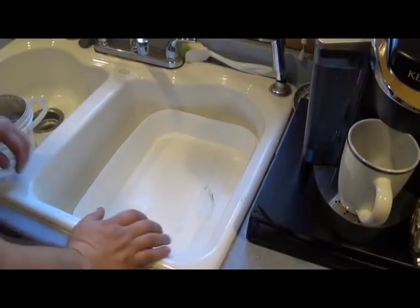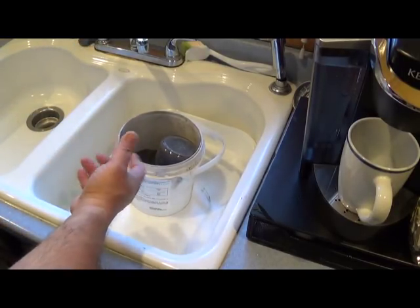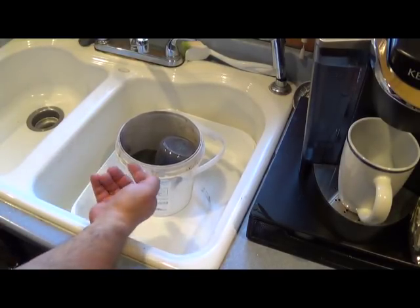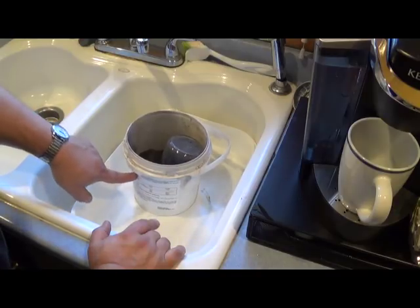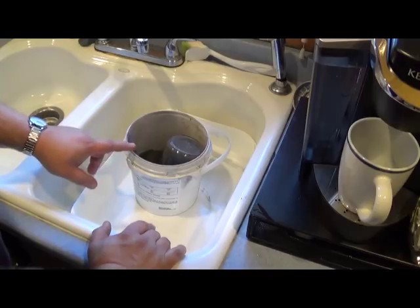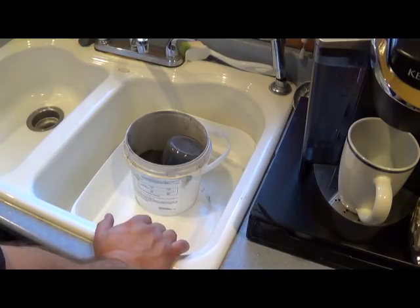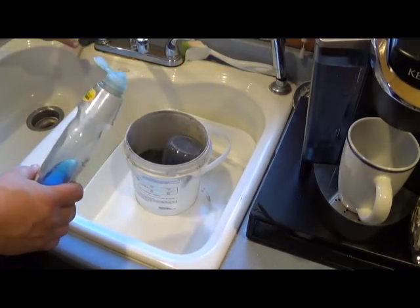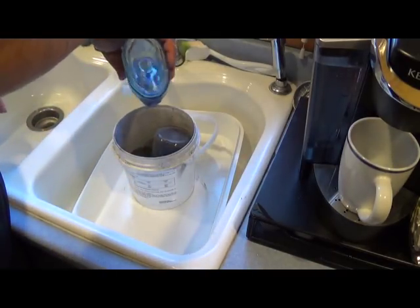So I'm going to take you into my kitchen and take a look at that. Here's what I've got: I've got a catch pan, something that I'm going to put this bucket into and start the water flowing into. What that's going to do is make all the powder and stuff — the ash and dust, which is lighter — flow up and over into this pan, and then this pan is going to flow over into the drain. The theory is that the gold, because it's so heavy, and any other metal that's left in there, should stay in the bottom of this bucket. But if any does get out, it'll get caught in this pan. It's going to be important that you use a little bit of Dawn dish liquid — you want to make sure that the surface tension doesn't keep any gold on top.